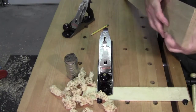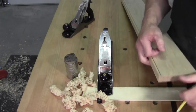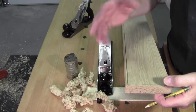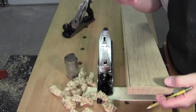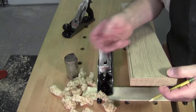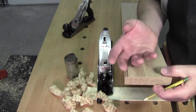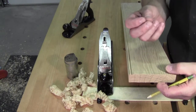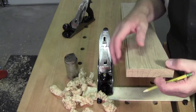I want to do a wine barrel lesson here. The difference between red oak and white oak is not just the color. Red oak does tend to have a more pinkish reddish tone that even after you do finishing on it, that red tends to bleed through — sort of like mahogany. Mahogany will do the same thing; you can bleach them and over time it will come back.